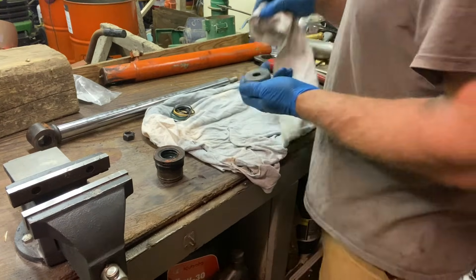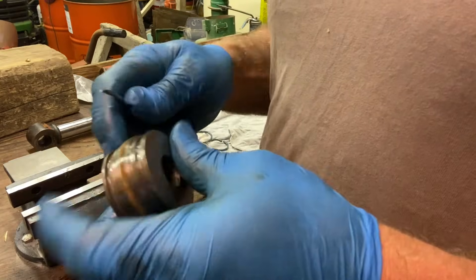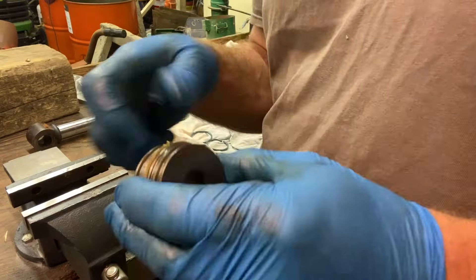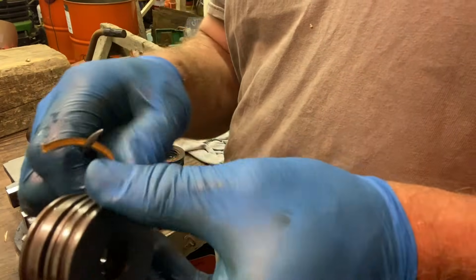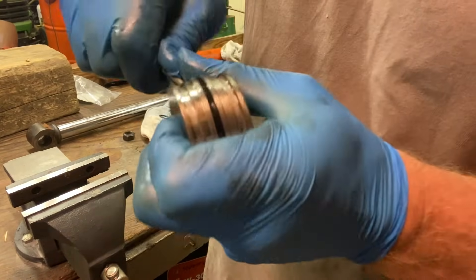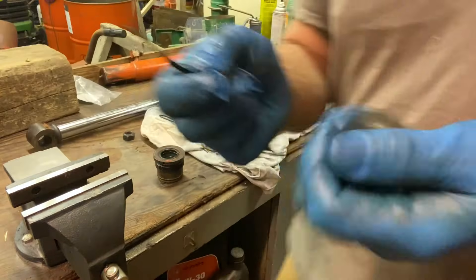This is the packing — we're going to change that first. You get a pick and carefully get under this ring. The old ring you just kind of force through with the pick until it breaks and then pull it off. Inside here there's a little rubber seal. Keep fishing until you get that o-ring, or cut the o-ring and it comes out easy.